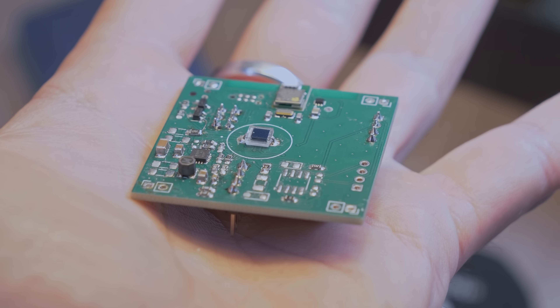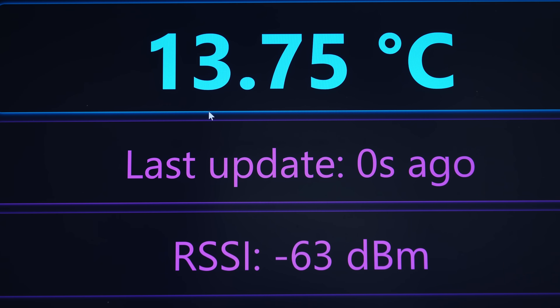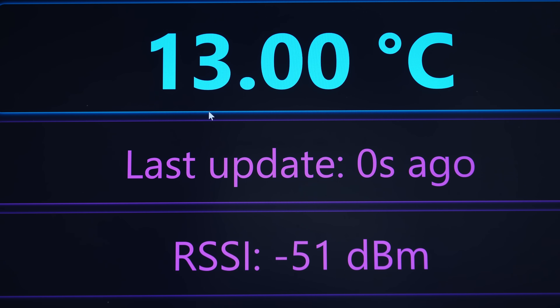I've placed a 100 microfarad capacitor in this circuit's power bank, and that's usually enough for it to advertise between one and three times before shutting down. This is perfect — it means it won't spend longer than it needs to charging, and when it's ready it will reliably transmit full packets of data, meaning it will periodically transmit as quickly as it can charge.